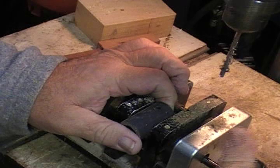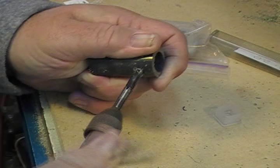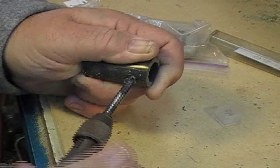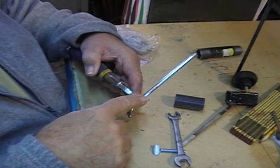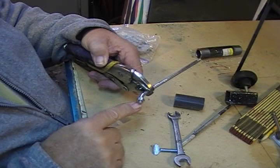This can all be done in steel pipe. I come back over to the bench and tap it with my quarter-twenty tap. See the little pen case in the background? That's what I store my tapping drills in to keep them handy and together — that one's for the quarter-twenty. Tap both the front and the back. Now I take my 7-inch rod — this is a carriage bolt I bought at the hardware. I bend it. You can't bend it at the threads, it'll snap, so you bend it past the threads and then cut some of the threads off. The other end you sort of pencil-point a little bit.